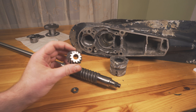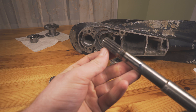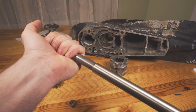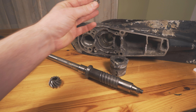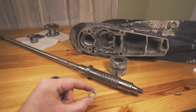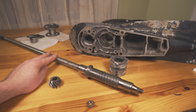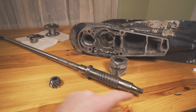There's one minor difficulty in doing this. If you don't have something to hold the top of the driveshaft — as you can see it has kind of a thread — you obviously don't want to break this because this is a motor and they're not cheap. If you kind of grip this with something you could damage it. So if you have no proper tool to clip onto the end, what I found is the easiest method is to take the gear case out of the motor, put some pliers into the gear case, grip this nut, then put the lower unit back into the motor and have someone else simply turn the flywheel by hand — just kind of grab it and turn it once hard. As long as the person at the bottom is holding a wrench onto this nut, it'll come out very easily. This way you essentially have a free tool. That's how I did it and it was a piece of cake.